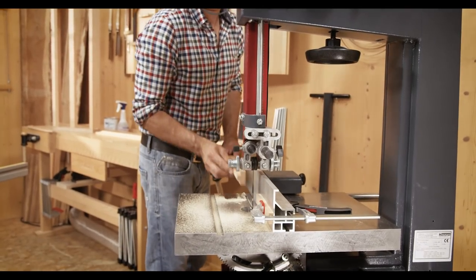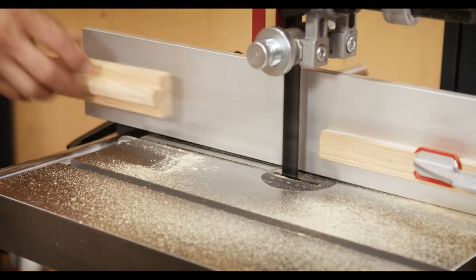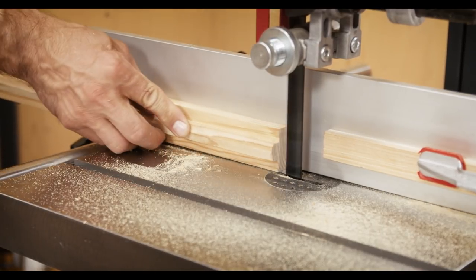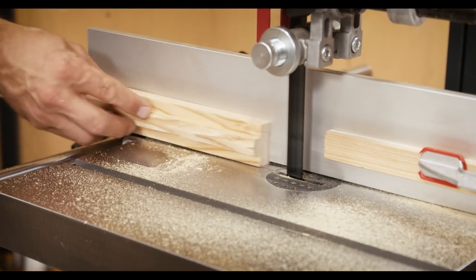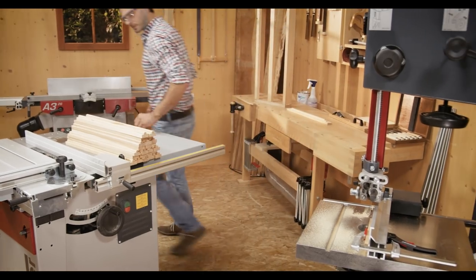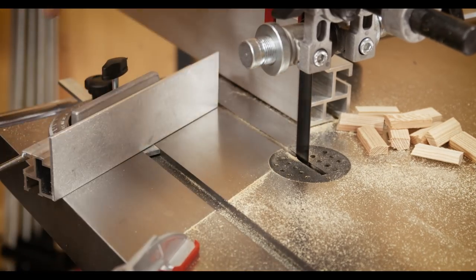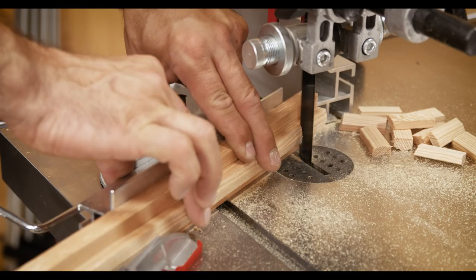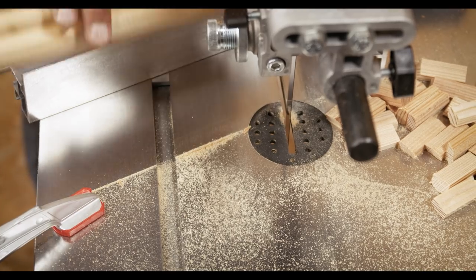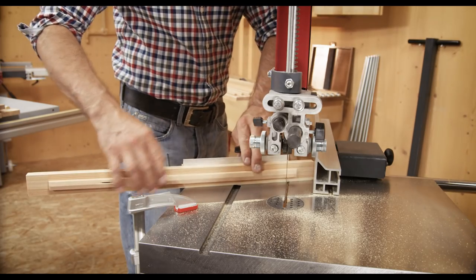The safest way to make a cut at the rear side is by using the bandsaw. For the next cuts, we use the mitre fence and the parallel cutting fence as a reference. We use a wood clamp as the end stop. Thanks to this cut, used as a spacing to the sidewall, we can prevent our bees building up to the sidewall.